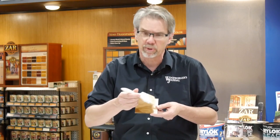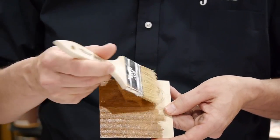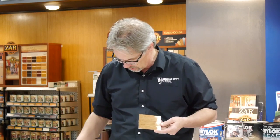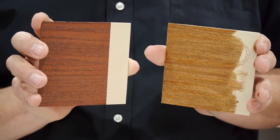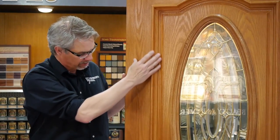After you've applied your stain, if you want it darker, you can apply a little more stain and leave it on. Or if you want it lighter, you can wipe it off. If there's pooling or runs, you can use a soft bristled brush to feather that out. This is what it looks like with teak natural stain, and this is what it looks like with a dark mahogany. Both look great and look like real wood. And here's an example of an entire door done in teak natural stain — it looks great.